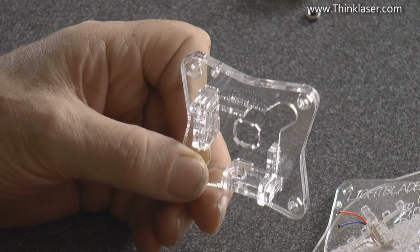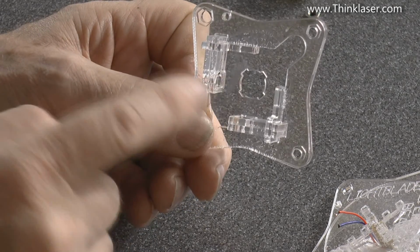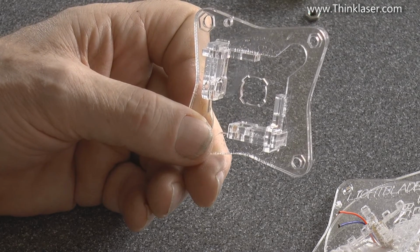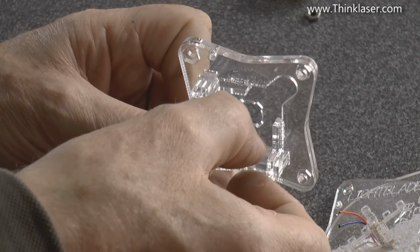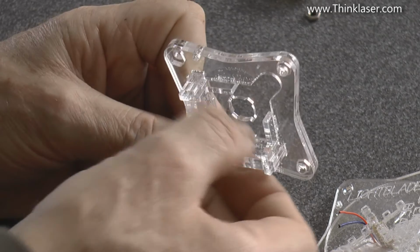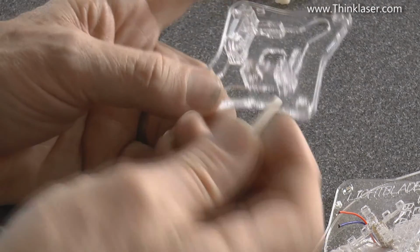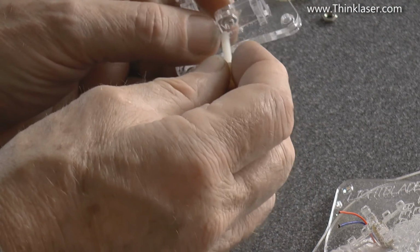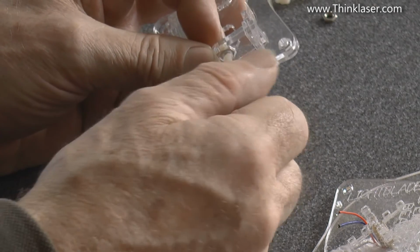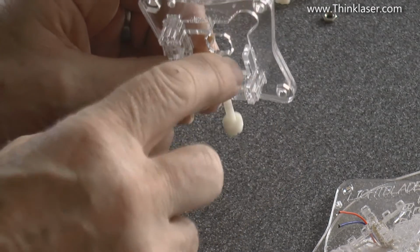Now in normal engineering circumstances, I would suggest you drill where we put the hole through there, and I would physically be putting a tap through there. But understanding that probably most of you guys might not have tapping facilities, what I've done, I've arranged to put a nut in there instead for a tapped hole. Okay, so we put a nut in there, and we put one of these long 1-inch plastic screws through there. But make sure that it doesn't stick out above this surface.